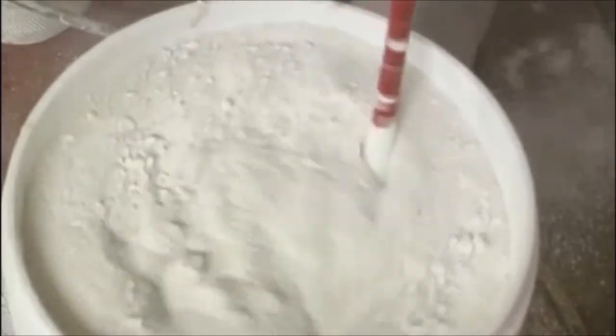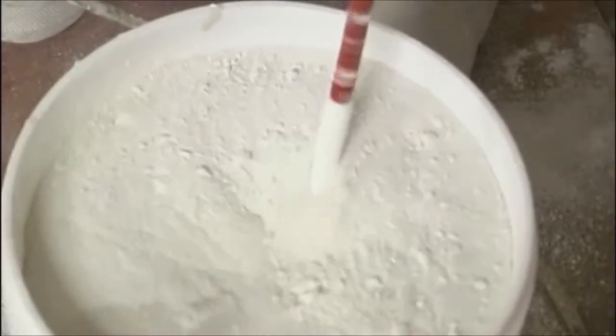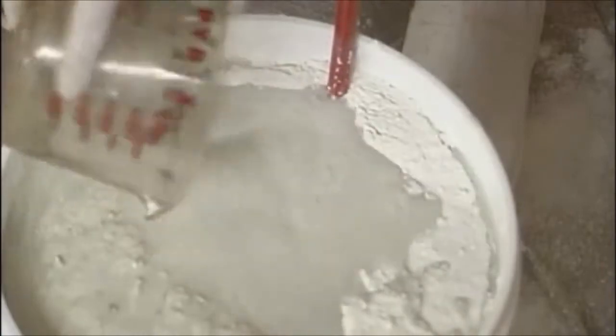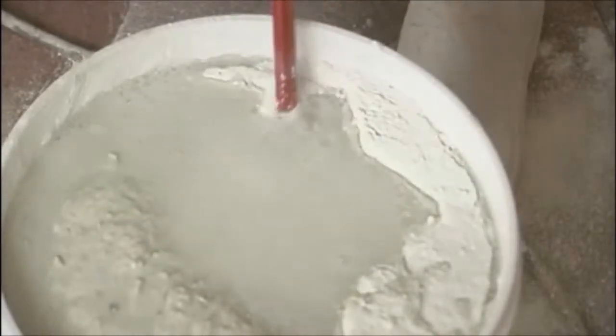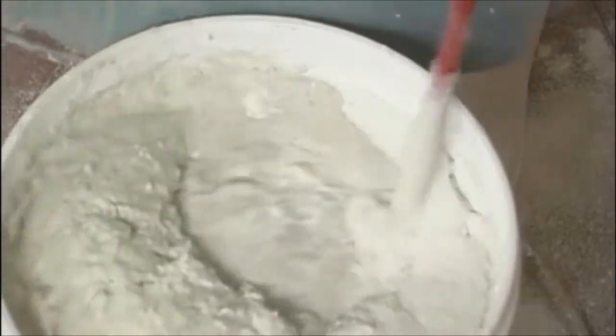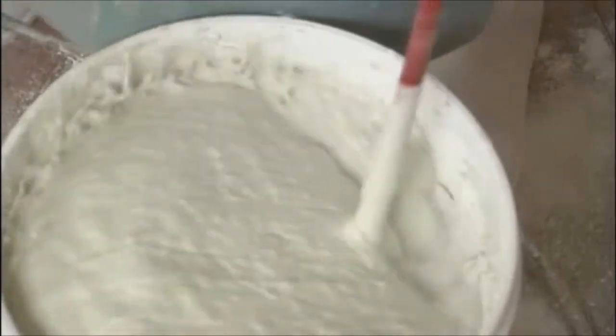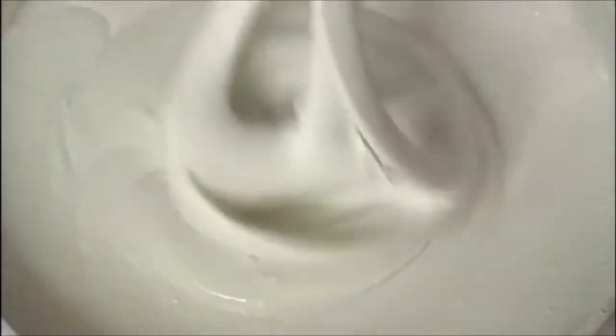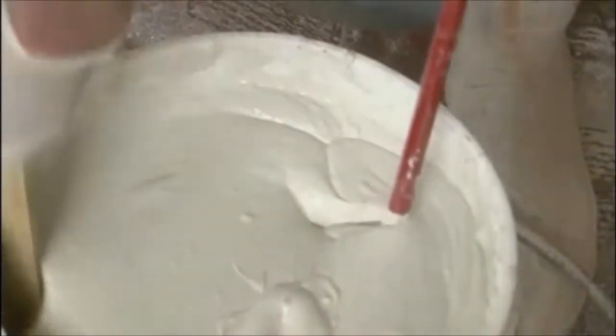Plaster takes more time to mix than gypsum mud or cement does. Always keep extra water on hand in case your mix seems too thick. Add small amounts if necessary when mixing. Try to produce a vortex when mixing the plaster. Stop mixing occasionally to let the air bubbles come to the surface. Make sure you lightly touch the bottom of the bucket to loosen any possible remaining powder.